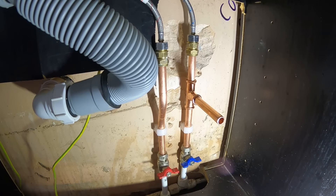Hot and cold connected, isolation valves at the bottom, isolation valve on the outside tap, and a double check valve — all done. Let's turn the water on and make sure this tap is working. Hot on, cold on — let's check it's coming out. Perfect. Switch between the two, then turn the outside tap back on as well. There we go, all done. Tap's in — typical jobbing bread-and-butter job. You'll be in and out in an hour or so, maybe a little bit more if you've got the pipework to tidy up. If you can get four or five tap changes in a day you'll be doing all right — there's good money to be made. Thanks for watching — hit the like button, drop me a comment below, and don't forget to hit subscribe.